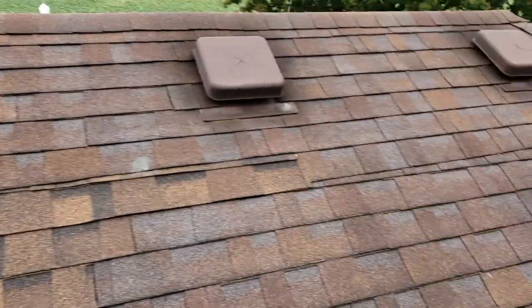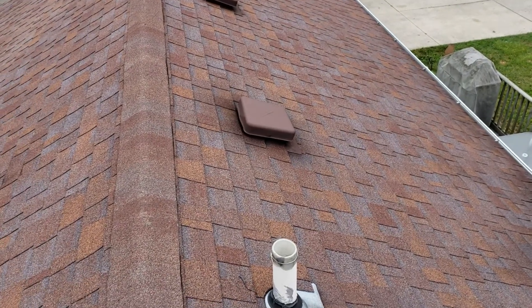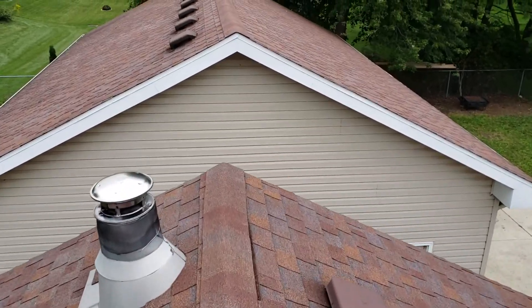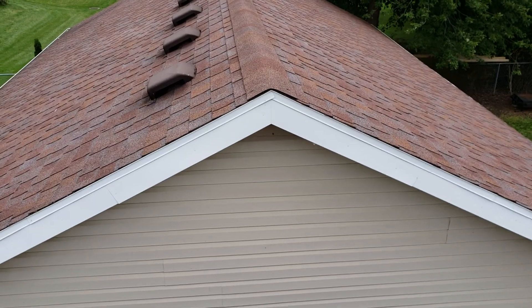The last thing I'll mention is your ventilation. You do have some roof louvers up here. What I would do in this particular house is eliminate all these — patch those in with sheeting — and then max out your ridge vent. I would actually do the same on the garage. There are so many roof louvers back there, you're probably pretty well ventilated. It just looks better and it's more functional to have a ridge vent, in my professional opinion.